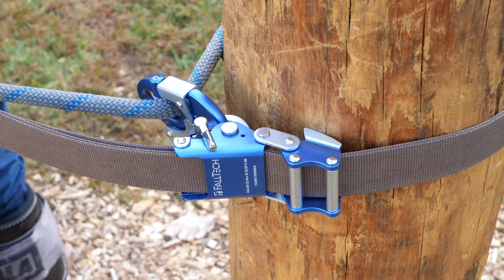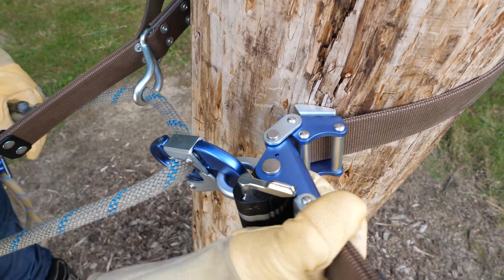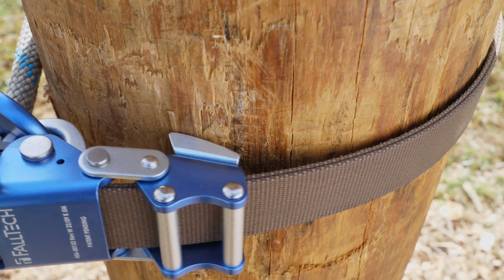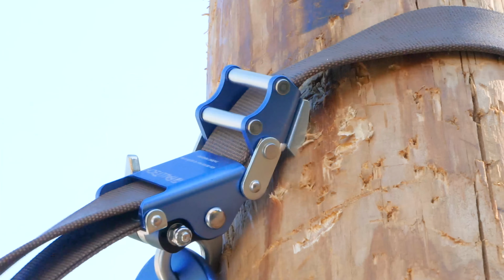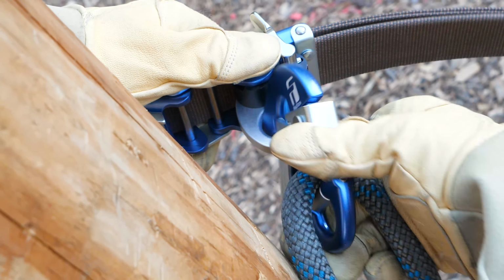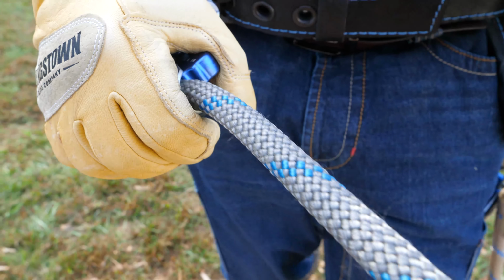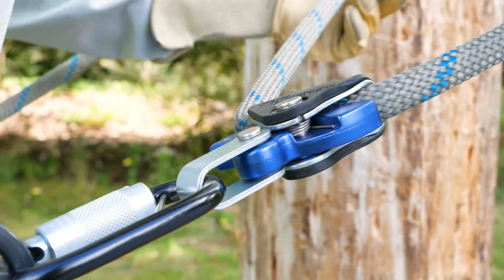This is the first device equipped with an articulating adjuster that forms to fit any size or shape pole, innovative non-interfering rocker cleats that reduce snagging while increasing stopping performance, a two-finger double locking snap hook that makes connecting and disconnecting fast and effortless, and a feature-packed horizontal rope adjuster made to accommodate a large, easy-to-grab 15mm Technora Kernmantle rope.